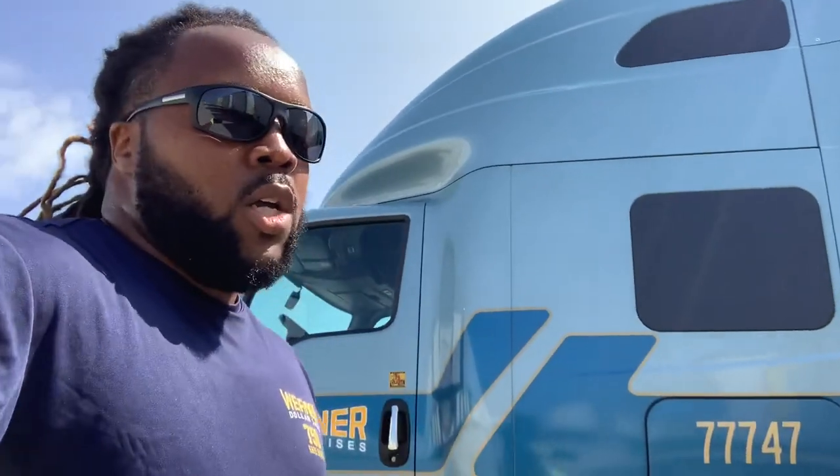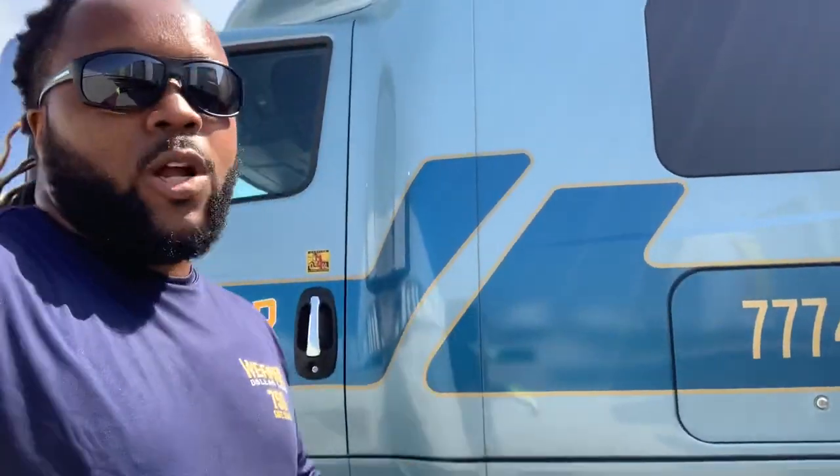But that's how I check my liftgate. The right way to do it is the way I showed you in the beginning. You always want to check the outside switch, the inside switch, and also check your green lights — make sure they're not flashing red. I hope this video helps somebody. If not, send it to somebody — it might help somebody. I appreciate y'all for watching. Hit that like button, hit that subscribe button. Every time y'all hit that like button, my video gets out there to help somebody. Hop in the comment section — I want to see 3K because I'm on my way to 3,000 subscribers. Y'all showing your boy some love, so keep showing me that love. Catch y'all on the next video. Holla at your boy.